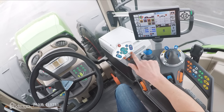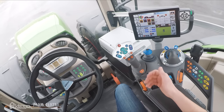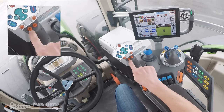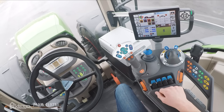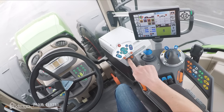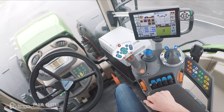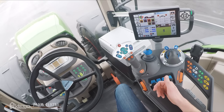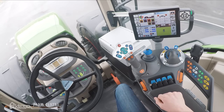If neither cruise one nor cruise two buttons are called up and illuminated, and we activate the cruise control, the tractor will maintain its current ground speed. Moving on, we have minimum and maximum buttons — those are engine RPM values programmed in your Vario terminal. When I press minimum, we get a readout in the dash that minimum speed is reached, currently programmed at 1000 RPM. Press it again to deactivate and it'll return to idle. Pressing maximum reaches our maximum speed set at 1200 RPM. Press it a second time to deactivate.